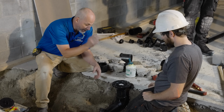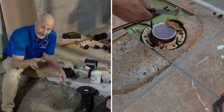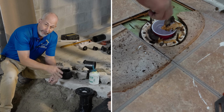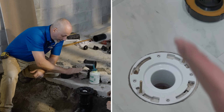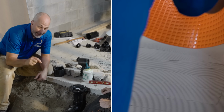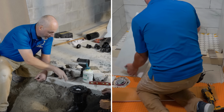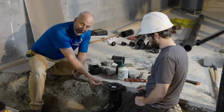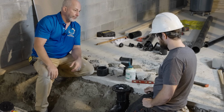Very important, guys. Jean just asked me a really important question about setting the height of this flange. If you've seen my toilet videos before, you know the height of the flange versus the finished flooring is the most important formula for a good toilet seal. We'll be using the Schluter Ditra direct on our concrete plus tile, which gets me to 3/4 inch thick. I know that because Ditra was designed to tile flush with finished hardwood, which is 3/4. So I asked John to lift this finished flange height a little above that 3/4, so we have a little exposure and get a perfect toilet seal. And that looks right on mine.